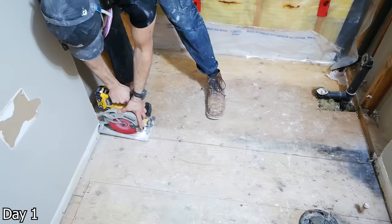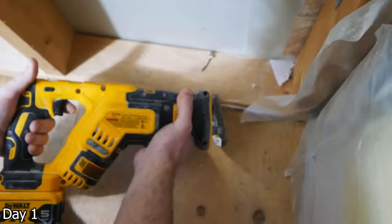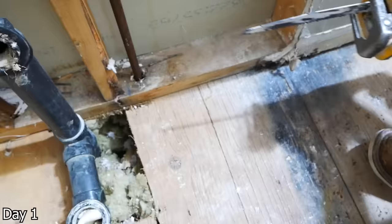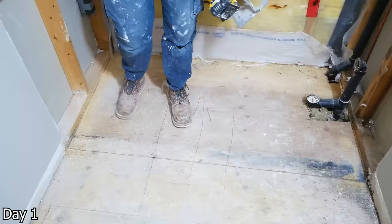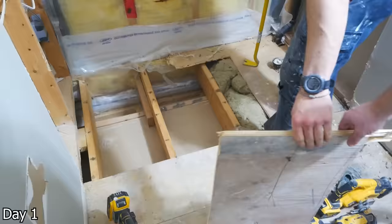Converting this from a tub surround to a walk-in shower means we have to rework the plumbing, which requires opening up the subfloor. Since we're doing a curbless shower in this bathroom, we need to open everything up. We're using a skill saw for the one straight rip, and a reciprocating saw with a wood blade along the edges at a shallow depth — you don't want to go too deep as there could be mechanical items underneath. Score all along the perimeter at the planned shower size depth, then do a few more rips to break this large chunk of subfloor into multiple pieces and pry it all up.